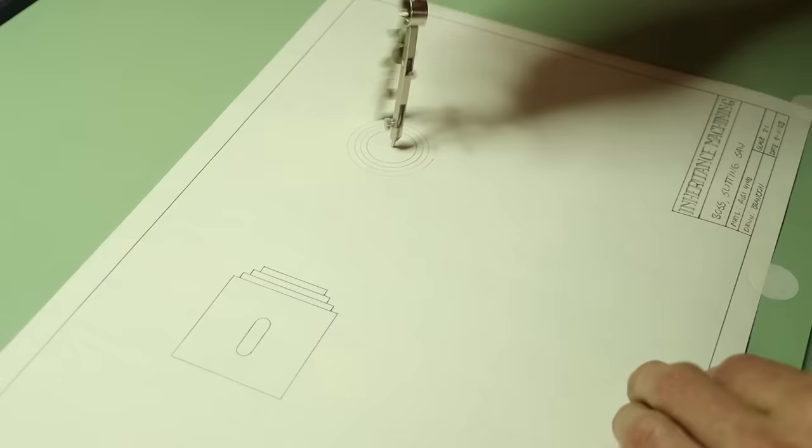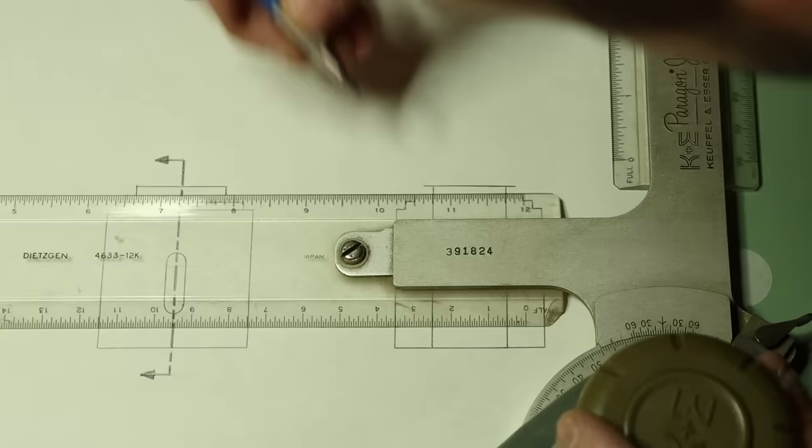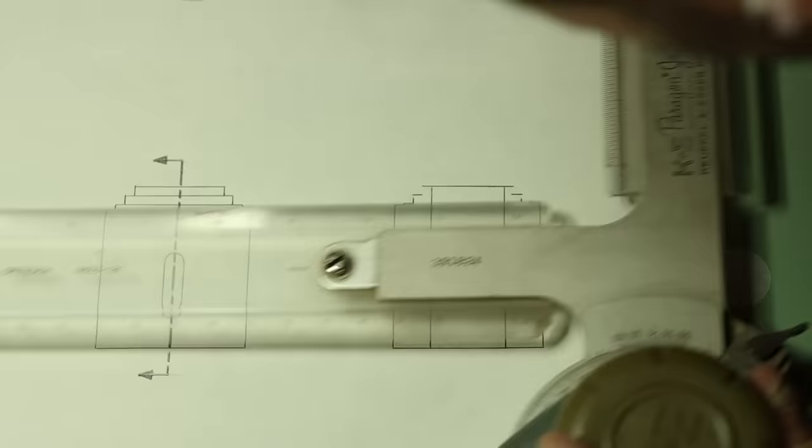The centering boss will use the same spring from the old arbor, because cheapskate says waste not, want not. And to keep everything contained within the end of the new arbor, I'll include a short slot that will ride along a simple pressed end pin from the outside.